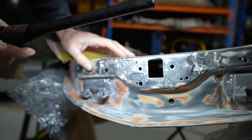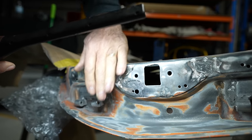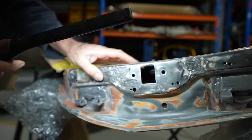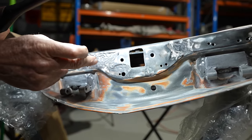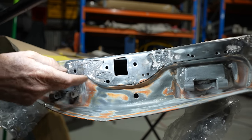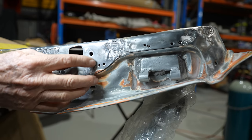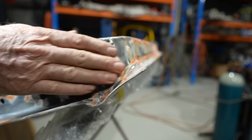And the outer skin, they've got like a support brace, these doors, in the front of them, right through there, inside. It's like a two-piece thing. You've got your inner and outer skin. And what's happened over the years is the moisture's got between the inner and outer, sweated, rusted, and eaten this right away. So what they've done is just fill it full of bog right across it. Through here was the same, just all bog, right through and around the corner there.